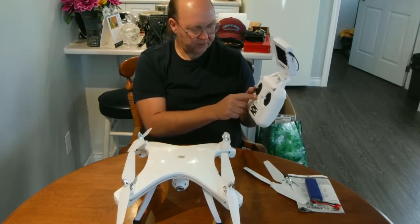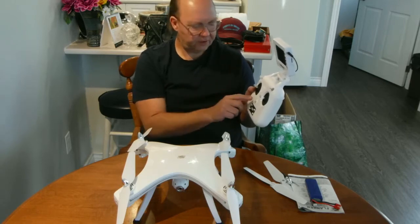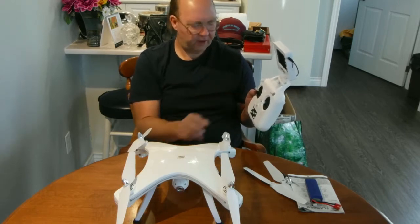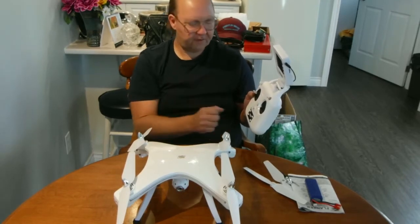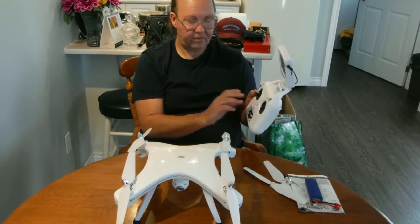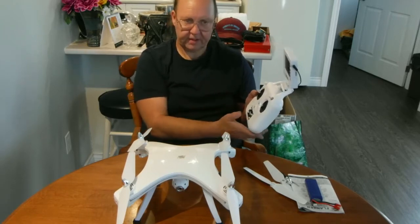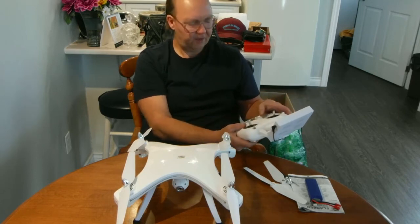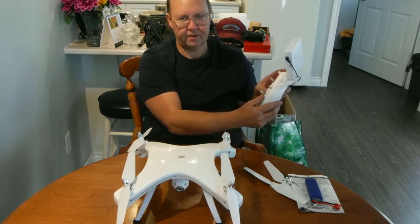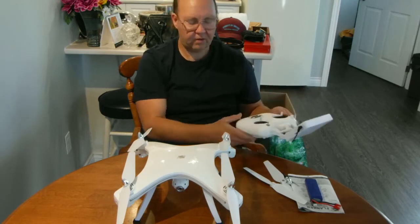When you are in the hold, it is up and down for trimming your height. When you're not in hold, up is turning your lights on and off, and down is your speed selector. So if you want to fly faster right away and then go into hold, first get into your second rates, and then hit altitude hold, and then you're going to be flying faster at your altitude hold. And then you just use this to trim your height if you need more height. Just boom, boom, boom, and gain some height, and away you go.